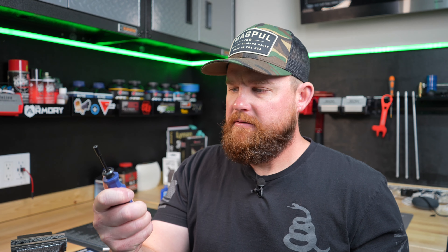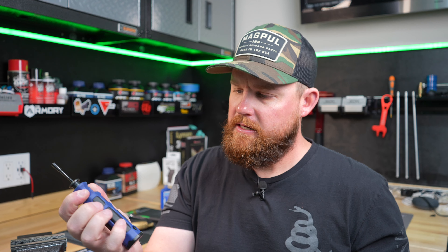So I'm just going to put it in the vise and use a drift to knock that out. You will need a front sight tool — these aren't expensive, I think I got this one on Amazon, it's a VISM brand. You will need a Glock front sight tool specifically, because if you try and use just a small socket, the walls on the socket are too thick and you won't be able to get up there on the little screw.